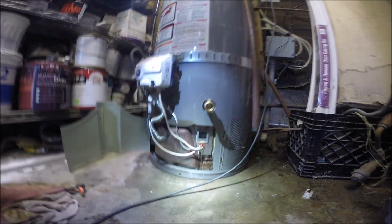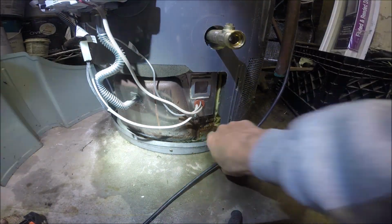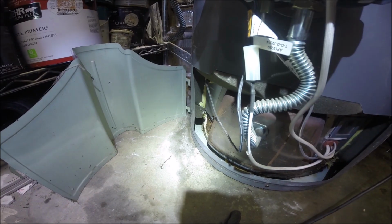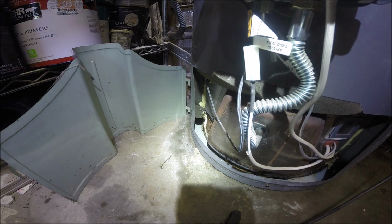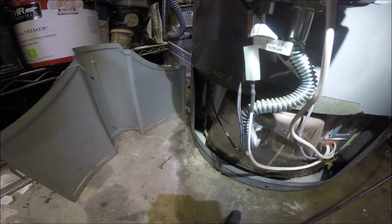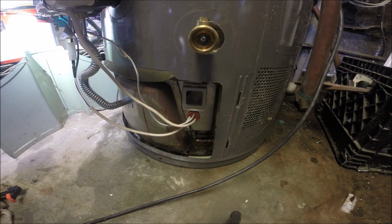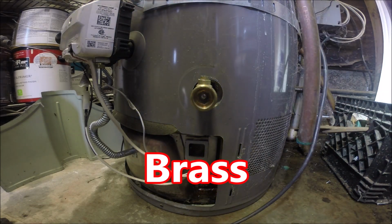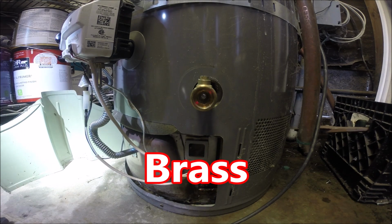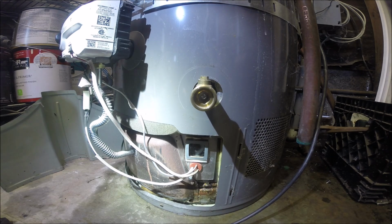What I do is I push the insulation up on the sides, just kind of push it up so you can get some oxygen in there. I do that on both sides, because basically that's just a big sponge and it just soaks up all the water and then just chokes it out. Get that out of there. Just remove any wet insulation and then change the drain valve out from plastic to copper. And hopefully that's it. There's no more water that shows back up.